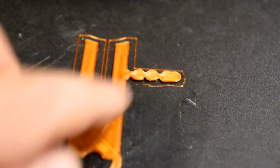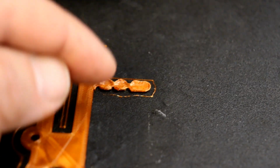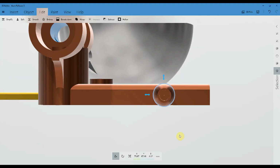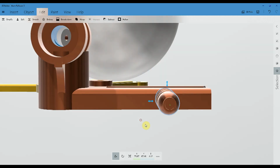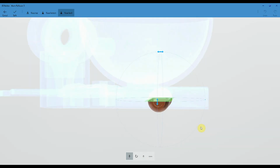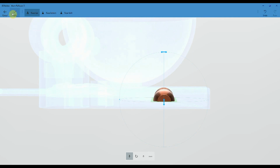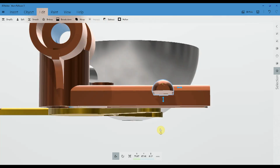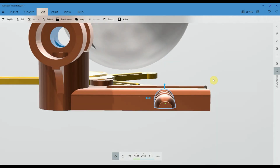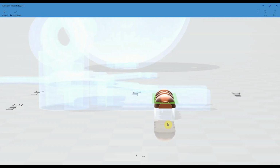So what I'm going to do is redesign it so it's got the circular top, but then just goes down straight. Now what I can do is I want to get the back flat. I will go to split, and instantly finds the centre, which is also very good. I wanted to keep the top, so I'm going to split that. There we are. There you can see I nearly managed to fill all of the inside in, it doesn't matter. Then I'm going to go to extrude down.